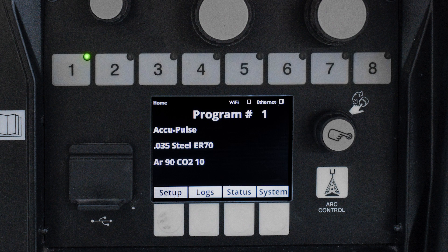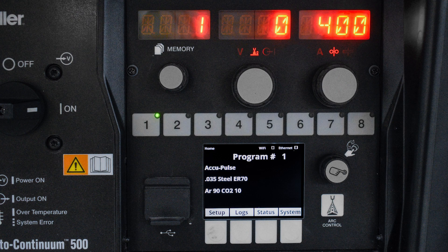AccuPulse is very good for a variety of applications. The nice thing about AccuPulse is it is synergic, so we would set a trim and a wire feed speed, where instead on MIG we would have to set a voltage and a wire feed speed. With AccuPulse, once we get our trim set, our arc length will stay the same no matter what wire feed speed we put in. This would be a very good range of thick to thin, and additionally, if you need to travel faster than a MIG process or an RMD, AccuPulse would be a great choice for a variety of materials and easier to program, since we have a trim and a wire feed speed.